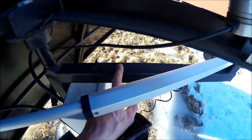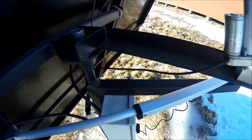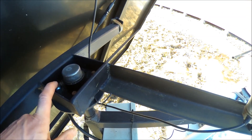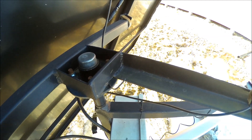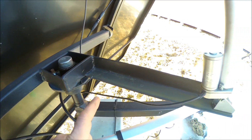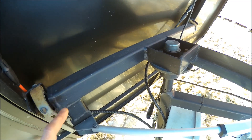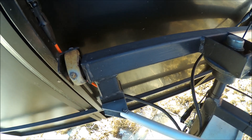This support for the linear element is the same dimension. Here I have a hub — you can buy them from a hardware store, it's for a 4x100 bolt pattern, just a hub if you want to put a wheel on a wagon or something. It has a bearing inside. Here I also have an angle iron 50 by 50, and the same 60 by 60 by 3 millimeter tube. There's an ordinary bearing here and a short axle welded to the support — it's only 20 millimeters.